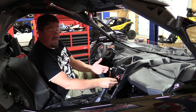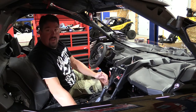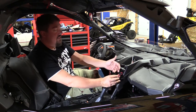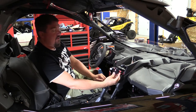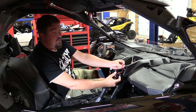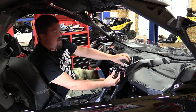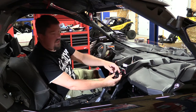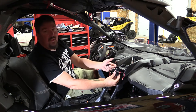This switch and the wiring that comes with the WARN switch can be used to power all three of these. There's a power supply down at the bottom that you're running switched power from, and power leads, and a ground — so all we're going to do is tap into these top switches. If I pull this red wire out, which is the one I'm going to run over to the bottom of my auxiliary switch to power it, the winch no longer works. We'll run another wire over to this power switch and it will allow me to turn on the auxiliary switch, allow the power to flow through, and then this winch will go.